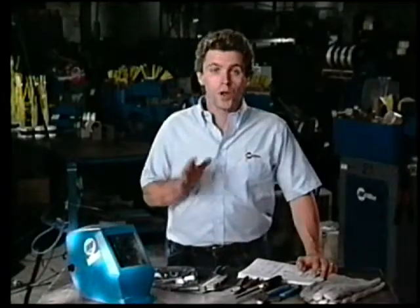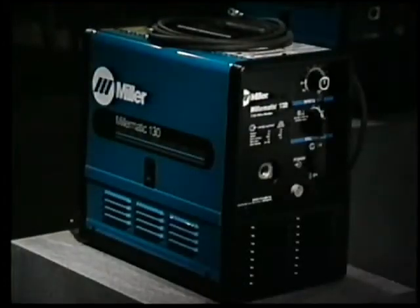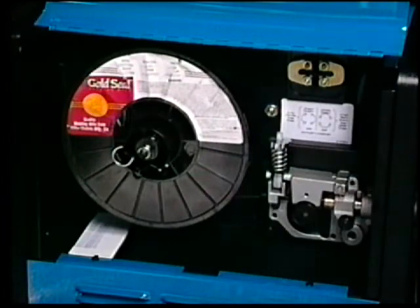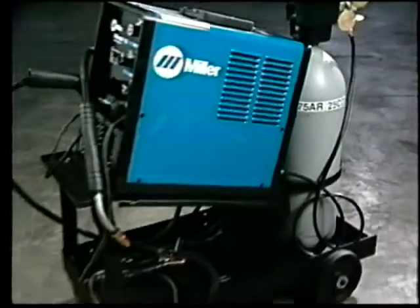And if you are a new welder or you just want to brush up on some basic welding techniques, we'll be using a Millermatic 130 for these welding demonstrations. We've already done the initial setup of the machine; a spool of 030 solid welding wire has been installed and fed to the gun, and a bottle of shielding gas is in place on the optional running gear cylinder rack. We have a couple of things left to do before we're ready to weld — first, we need to adjust the shielding gas flow rate.